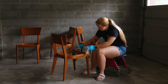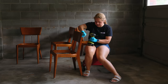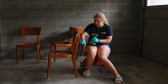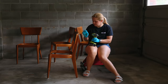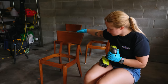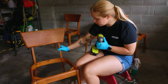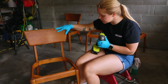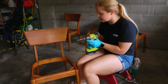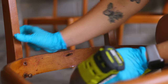Cleaning is done, at least round one of cleaning. So I'm trying to decide if I want to dismantle these chairs or not. I know I'm not going to take these off the top piece here because where the screws are, they're filled in with wood pieces and I don't want to even attempt to do that. But if you turn it around, there are some screws down here that I could unscrew, and that way when I am stripping off the finish I could get into these grooves really well. So I think it would do me well to go ahead and dismantle them, and kind of label them so that I know which chairs they go back to and which pieces belong together.